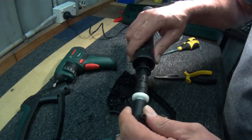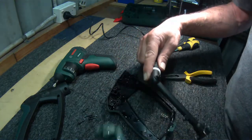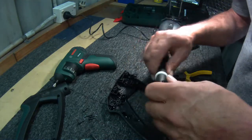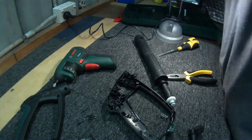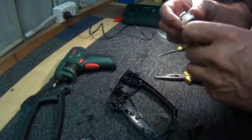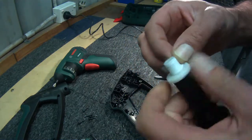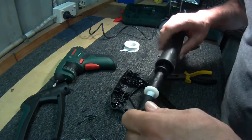I believe that's a problem - there's a bit of play there, so I think the water is going up here, squirting out there, returning back down the handle, which is why it's all wet in here and going back out the bottom. I might just do a quick fix to see if this is the issue - see if we can seal this up. I'll have to look at getting this particular O-ring which doesn't come in that kit, which is a pity. Let's see if we can do a bit of backyard fixing here.